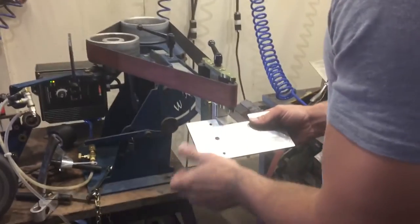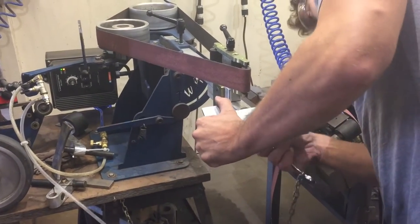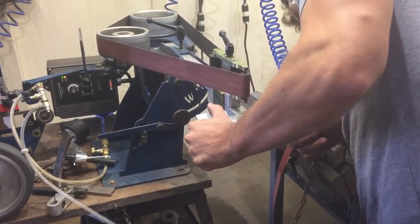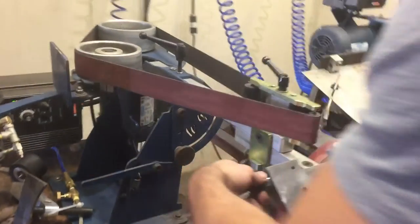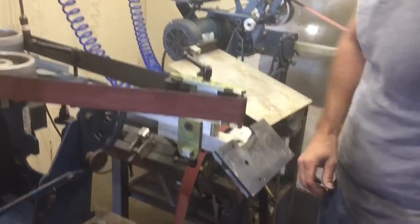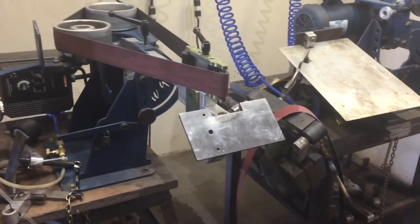With that there, I'm pretty well centered. I'm going to tighten it up in the long block, because this nut's going to be easier to get to — to tighten it up. That's about centered. Now I can set my chamfer angle to whatever I want. I think I'm about a 45. But in most situations without these plates, this would not be handy, because it's just too far away to really use. And that's why I made these up — I can do the same thing.